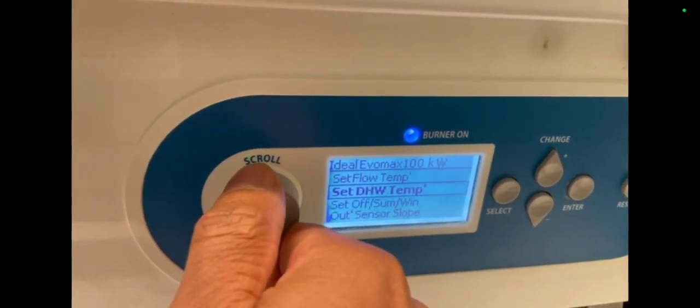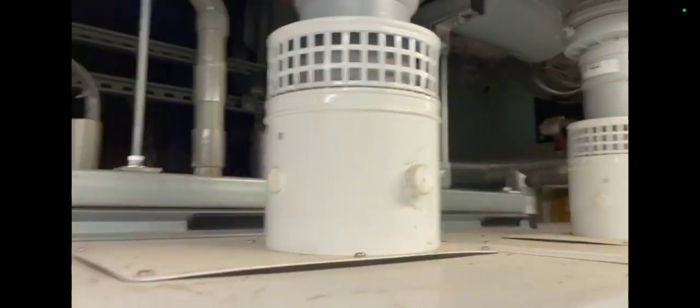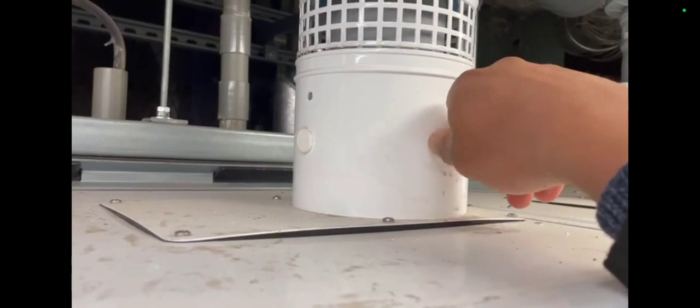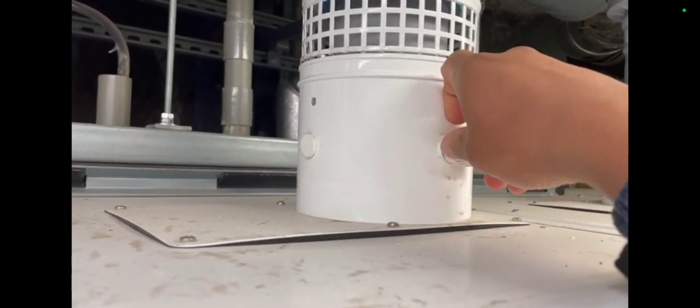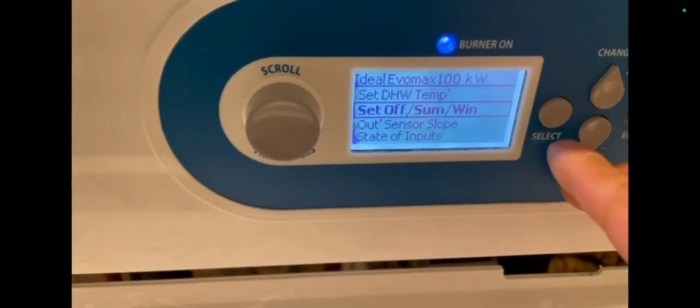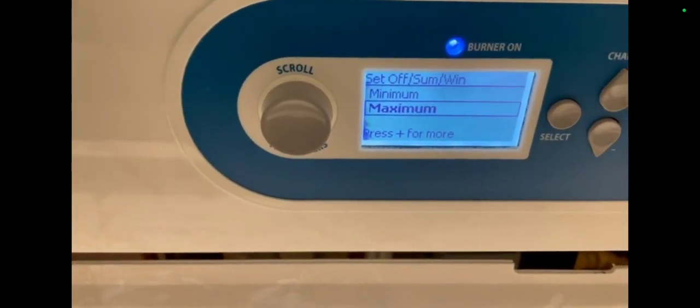I need to create a switch live to these boilers. I'm getting my pump ready, purging my analyzer, and getting my test points ready as well. Always remember to put these back on — I know an engineer who kept them in his mouth just to make sure he didn't make the mistake of leaving one off. It's easy to happen, so always double check; it doesn't hurt to check two or three times, or make a habit of taking a picture.